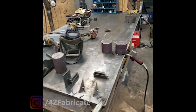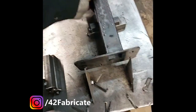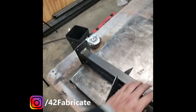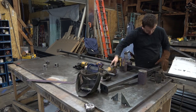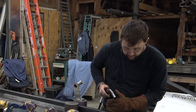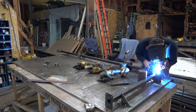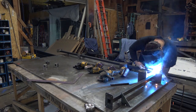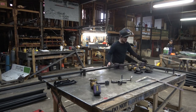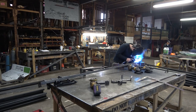We're setting the jig up to make these L-shaped pieces. The first piece gets dropped in, pulled tight up against these stops. Second piece dropped into place, pushed flush. You can see a jig here is totally worth it. We had a jig to put the flanges on the legs, and another jig to put the flanges on the ends of these eight-foot-long runner pieces. Those flanges are plasma-cut 10-gauge going onto this inch-and-a-half square tube. We cut a square into the flange with a little dog bone on the corners so the square tube slides right in. Square it all up and you're good to go.